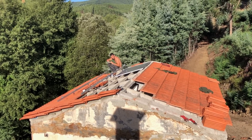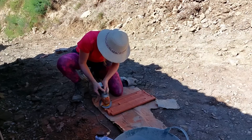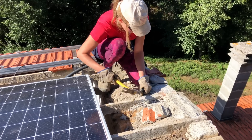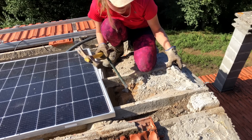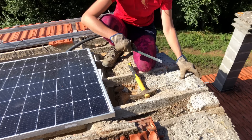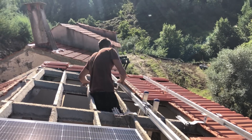The first row is in! We need to take out a little bit from the tiles under the solar racks — it's my first time on a grinder, and yes, I have safety glasses now. I'm getting better at this. Where this tile was flat and the bracket was here, there was a gap. Now it sits just below, so it's watertight. Much better!